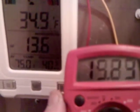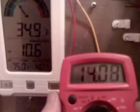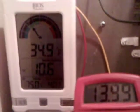Now in a real light wind, you can hook these in series. You only get half the amperage you do when you have them in parallel, but you pick up your 12 usable volts at about half the RPMs. In a minute I'm going to wire these up in series and shoot another part 3 of this video, showing the kind of voltage we're getting today at this wind speed with them wired in parallel.